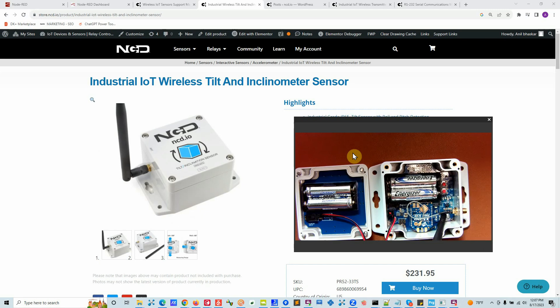The sensor is here — the tilt sensor. There's also an LED which blinks based on what is happening. If it sends data it will blink once. If it cannot talk to the sensor it will blink twice, then once-twice to show there's an error, and once to indicate it sent a message containing the error code. If it blinks three times it cannot talk to the radio module, and it will keep blinking three times until it can. In that situation something may be wrong with the radio module or some settings may have been altered.